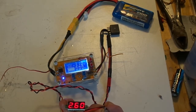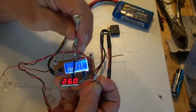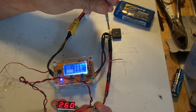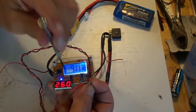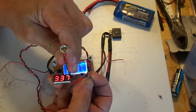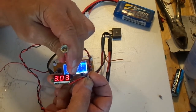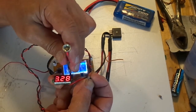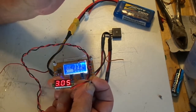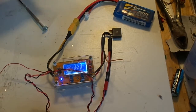The reason the power supply reads differently from the charger wand output is because it's going down through the diode, which drops the voltage. So watch the red numbers on the voltmeter at the charger wand and dial the power supply up until you see 3.1 there. Close enough — 3.05 to 3.10 is fine. That's our voltage set. Now we want to set the maximum amperage for our capacitor.